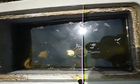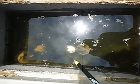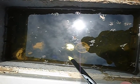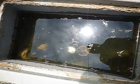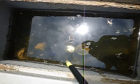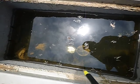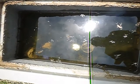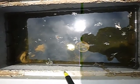Inside this water meter, right in here, that dial over to the left a little bit, you can see it kind of peeking out, that little red sprocket thing. It's called a flow indicator. Some people call them cheater wheels or cheater pedals, but it's very sensitive. If that guy's moving, then water is moving into the house. So if that guy's moving, something should be on. You should have flushed a commode, the dishwasher should be on, somebody should be taking a shower, take your pick. But when any of those activities happen, that little wheel will turn.